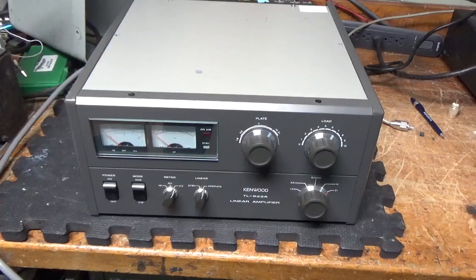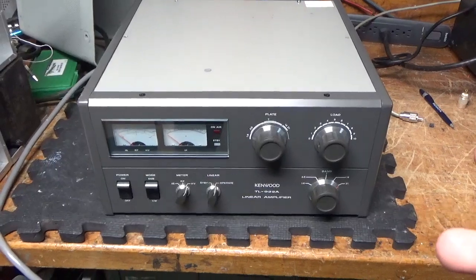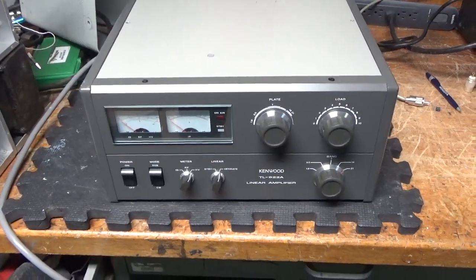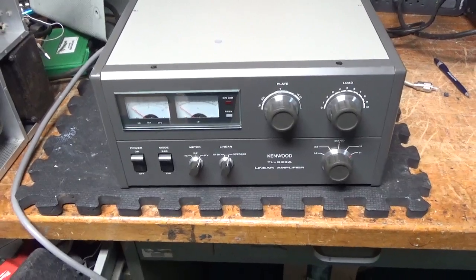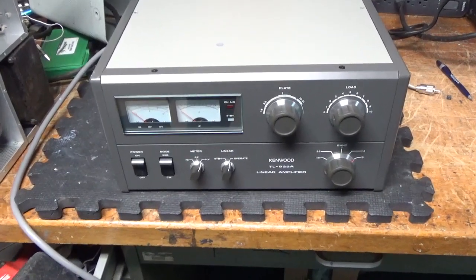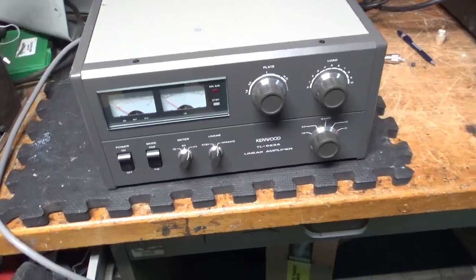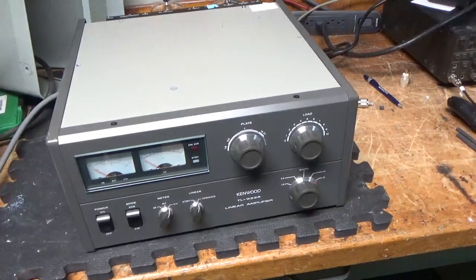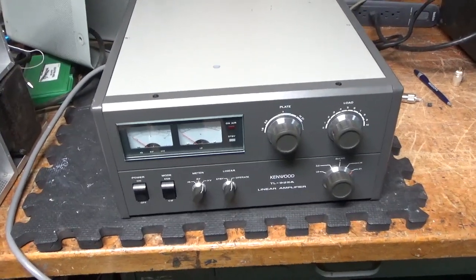The variable capacitors look okay. He needs a Zener diode for the bias circuit — someone added a different one and put it in a different location on the mounting aluminum bracket piece, so I'll fix that. I'll ground the grids and do everything else I normally do. Stay tuned, and I will see you guys soon.